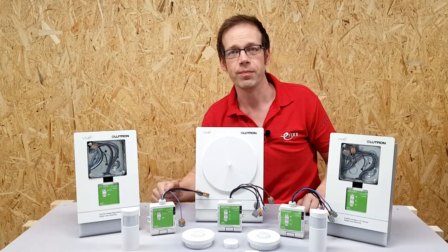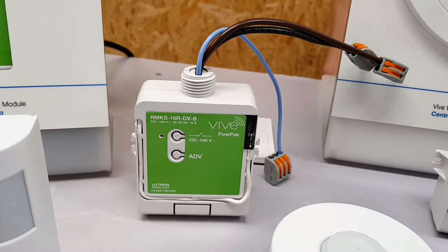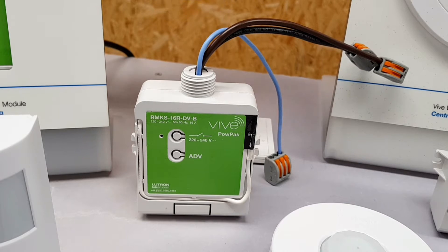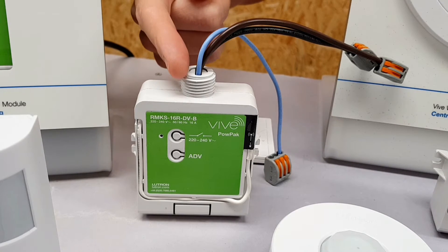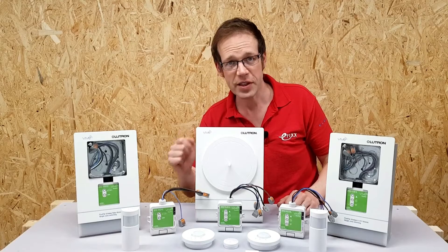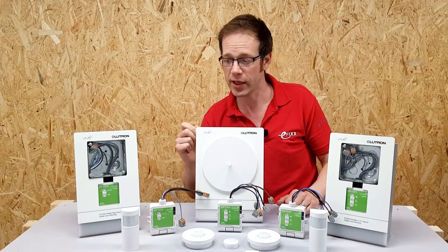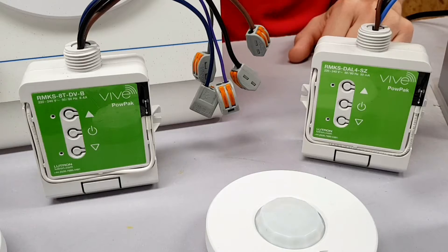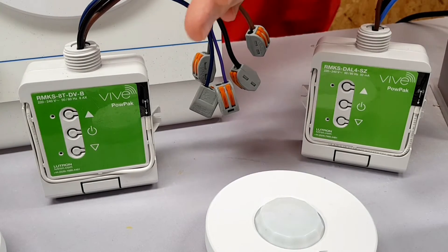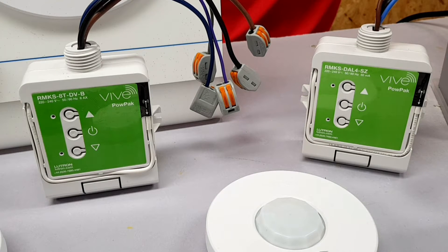The power packs do the actual physical switching of the lighting. If you look at the conductors out of this one, you can see you've got the permanent line, the switched line out, and the neutral. It also has a 20mm diameter threaded connection so you can fix this into an adaptable box, a conduit box, or for more advanced installations perhaps an LCM. This can be connected up to control a single fitting or a circuit controlling several fittings. It also comes in additional forms to allow for dimming using 0–10 volts or DALI broadcast control, as well as mains voltage dimming.